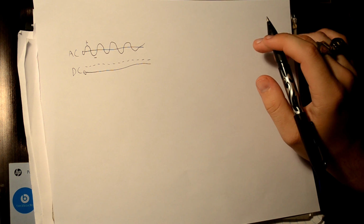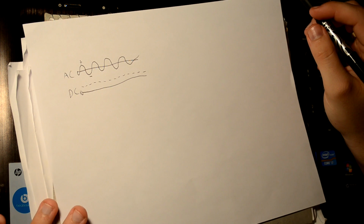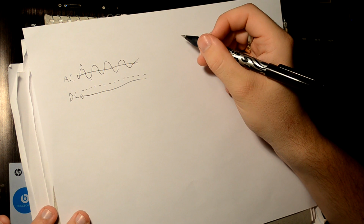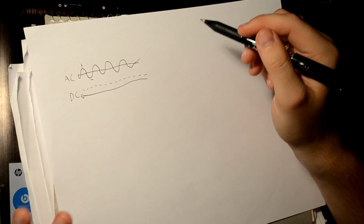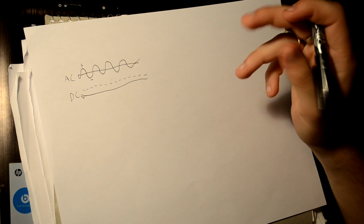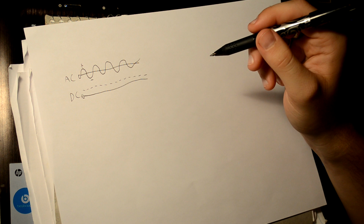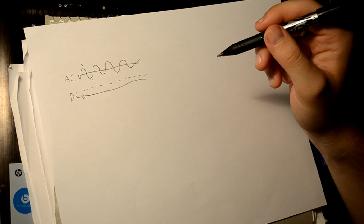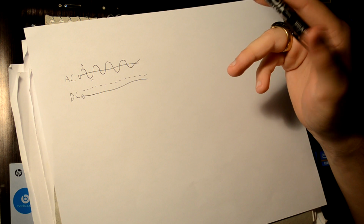it to function properly. So, if we only have AC voltage at the wall, how do we get the DC? Well, in the amplifier there's something called a rectifier. A rectifier is something that converts AC to DC. In the amplifier that I just showed you, it has a solid state rectifier which uses diodes, but some amplifiers have a tube rectifier.